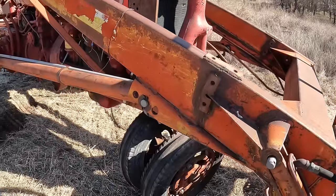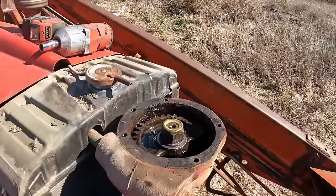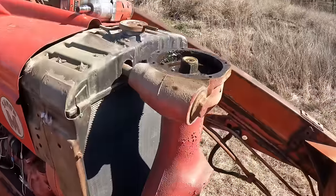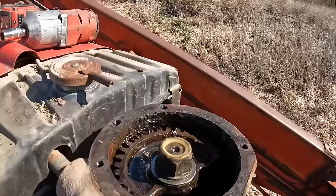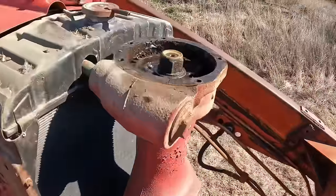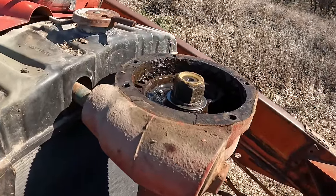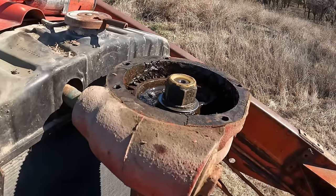So through some investigation and careful thinking, figured out I got this thing somehow 180 off when I was bolting stuff up. I got it lined back up again there. As you can see, I took my bar and barred it over and got the steering wheel turned, but now I got a bolt in the wrong place that keeps it from steering too far one way or another. So now I gotta take that apart and get us spun back around the right way. Oh, what fun.